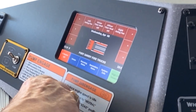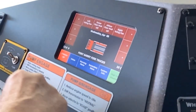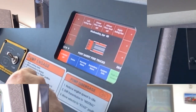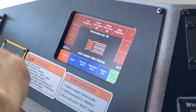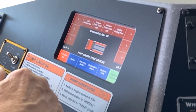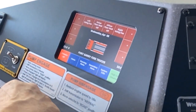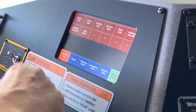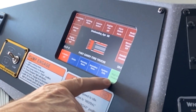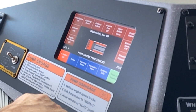There's a secondary menu with two fans, one on either side on the windshield — it turns the fan on and off. Note the switch at the fan doesn't do anything; all your controls are over here on the VMUX. There are also heaters underneath the driver's seat and officer's seat controllable from here: low, medium, high, and off. System info gives you information about the engine, transmission, chassis, and service info. On the right-hand bottom corner is your high idle — diesels don't like to idle, so you can put it on high idle to keep the engine warm, especially in winter.